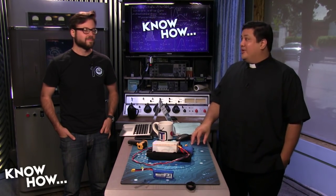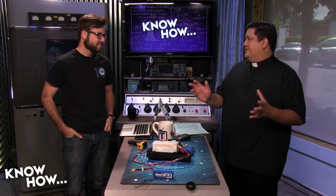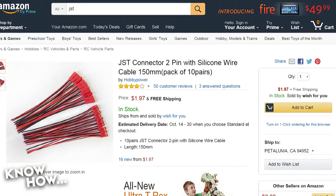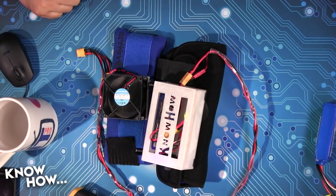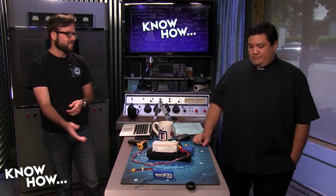If you want to create something like this, it's actually really inexpensive. The electronic speed controller is between $10 and $14, depending on how much power you want it to support. The servo tester, I got those for like $0.99 each — I had to re-solder a few things, but $0.99, who cares? Then there's the XT60 connectors and the 16-gauge silicone wire. Most of the stuff I had on hand. Almost everyone probably has a gel pack in their freezer, and this fan came off a busted power supply. The only expensive thing would be if you wanted to go all in and get a 3D printer — but you don't have to. You can download the files and get them printed somewhere and have them shipped to you.